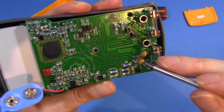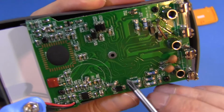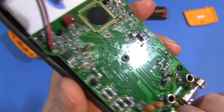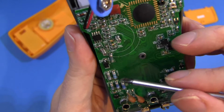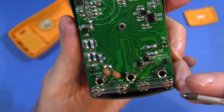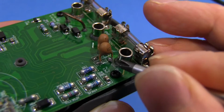And 2 PTCs on the input protection here, going up there. Resistor ladder, surface mounted resistors, very nice. And up here there should be a MOV, but I can't see one. Yeah, no MOV. So not perfect, but what do we reckon? Cat3 rating, without going into detail. I mean, certainly the basics of proper input protection, which is what we want.